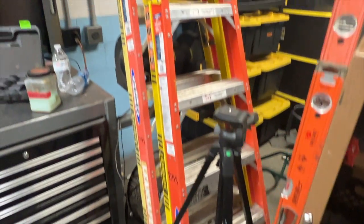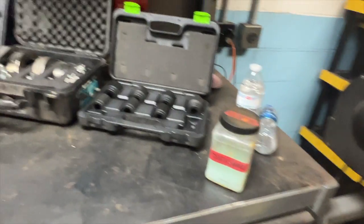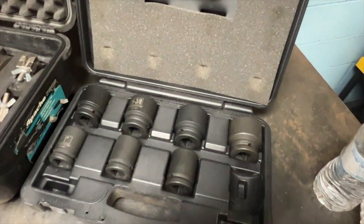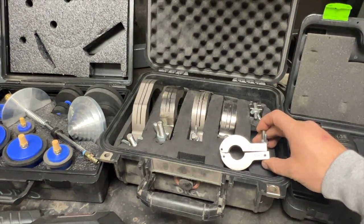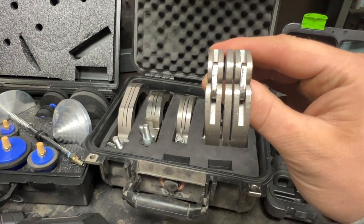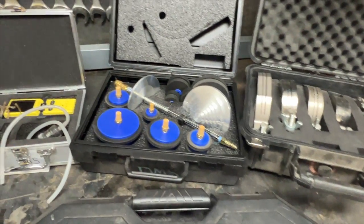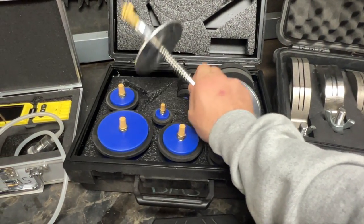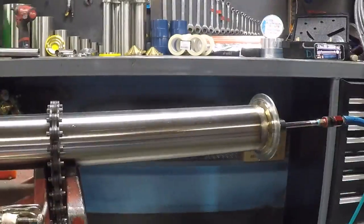I also want to shout out these six and eight-foot Lean Safe ladders — they're A-frame ladders but also made to lean up against a wall, an outside corner, or an inside corner. Super handy in certain situations. This is a container of death sauce or wonder gel — I use that for passivating, cleaning the color off of stainless steel welds. I've got the Harbor Freight special here, up to inch-and-a-half impact sockets. This is my saw block kit from Tech South — sizes one inch up to four inch, for putting a very square cut on sanitary tubing. Large and small slots for either bandsaw or Sawzall blades, all with wing nuts. Then there's this purge kit from purgeplugs.com: inch-and-a-half through four-inch purge plugs with diffuser, a purge tree, and a back purge for purging ferrules. If you want to know more about purging stainless steel pipe and tubing, I have an entire video dedicated to that on my channel.